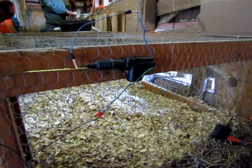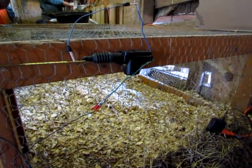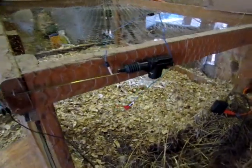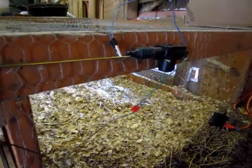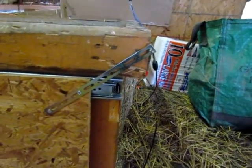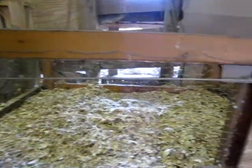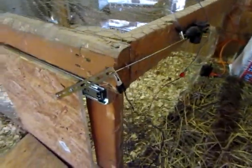The challenge here is that we can set a timer or a photo sensor to activate the circuit, but you don't want to apply power to this actuator constantly, so we had to have some way to kill the power as soon as the door opened. The timer activates the circuit, the actuator retracts and pulls down this rod. This rod is attached to this bracket, which is attached to the door, and the door has tension on it from a bungee cord attached to the other end — so that's pulling on the door, and the door is being held shut by essentially the door lock.